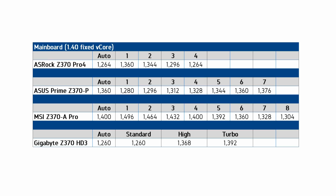As I said in the beginning, instead of doing some theoretical testing of the MOSFETs and comparing specs, we are doing a test where I set all the mainboards on an open test bench with basically no airflow, and this way you can compare the capability of the heatsink to dissipate heat and also the capability of the MOSFET to check what the power draw is like.